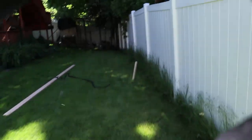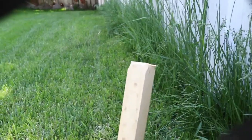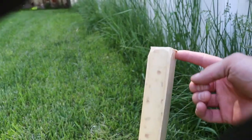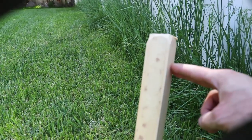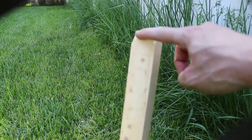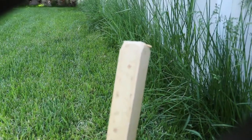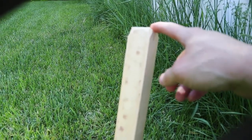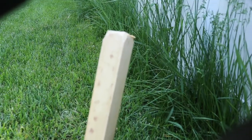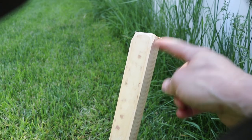But come down here to this one, and you notice it's still trying to bow out. It's still trying to spread out like that. When you hit on that, the wood's gonna end up mushrooming out. And chamfering is taking this edge around here and just cutting it off with your knife, giving it almost a rounded appearance like that. Anyway, that's called chamfering.